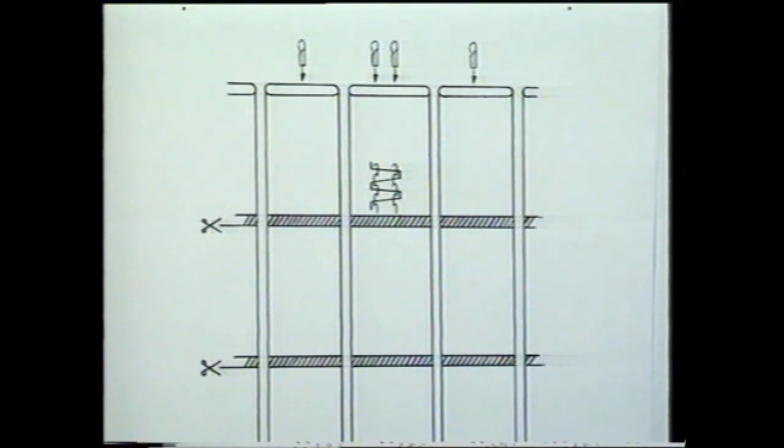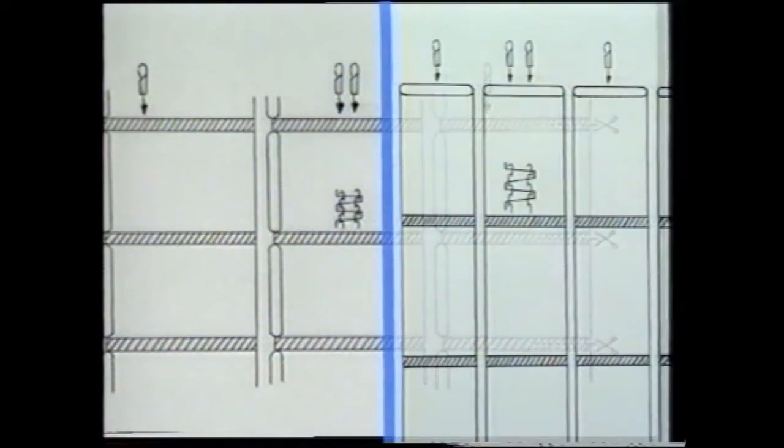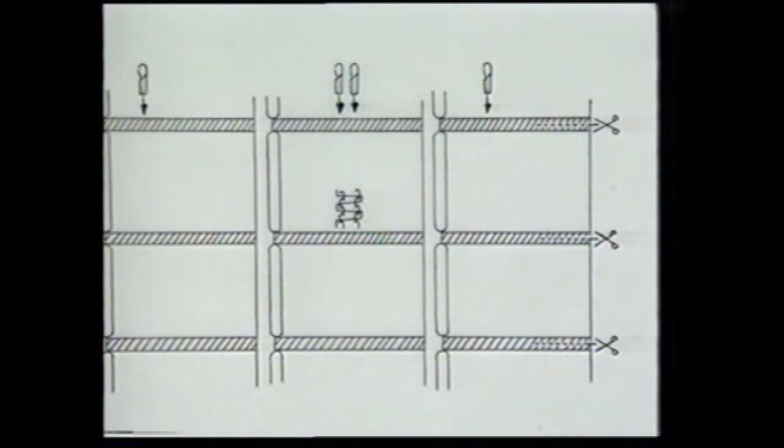The packaging sacks can be manufactured both horizontally and vertically on the Russell machines. For example, the sack opening can be made at the top or at the side. In the most commonly processed type, the sacks run at right angles from the machine so that the manufacturing process takes place as follows.